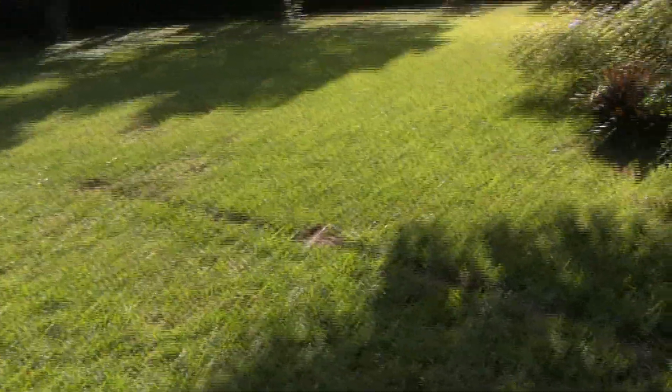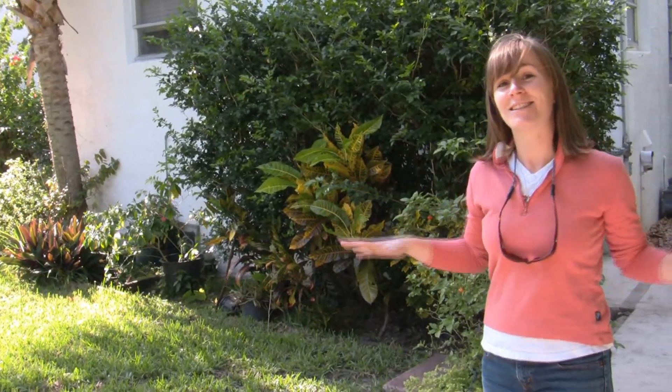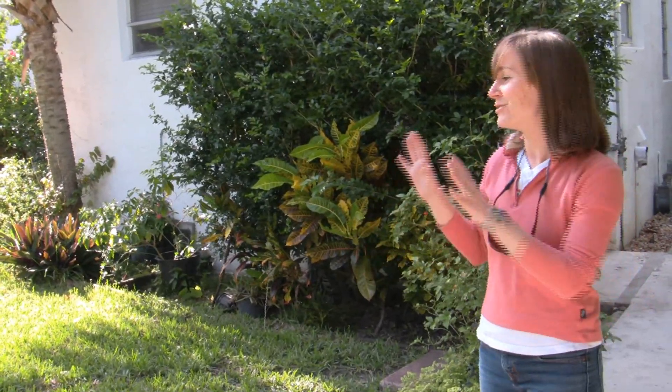Right out there in the landscape you can see where the sensor was buried — it's in a nice location. It's grassy and sunny, full sun most of the day. So it should be a nice dry area, meaning irrigation is only prevented when it's not necessary. Basically, if the driest area gets enough water, everything gets enough water.